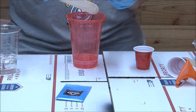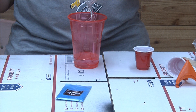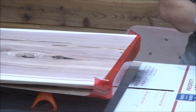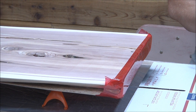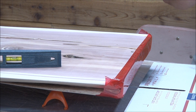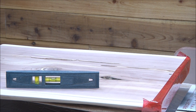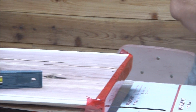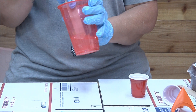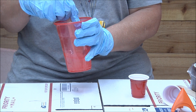Try not to spill it because it's really yucky. You want to put protection down — don't leave home without your gloves and your plastic. Also, we made sure the board was pretty much level. It's not as critical on this pour since we're just filling holes, but a little torpedo level helps to make sure you're level. Don't mix it too fast or you'll create a lot of bubbles — just keep it going for three minutes.